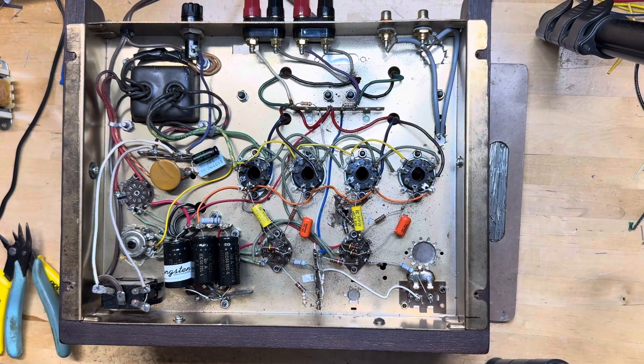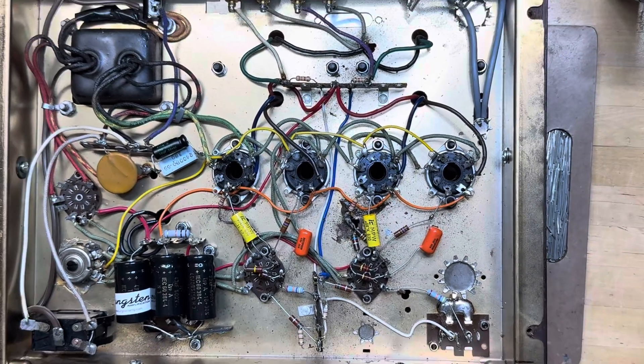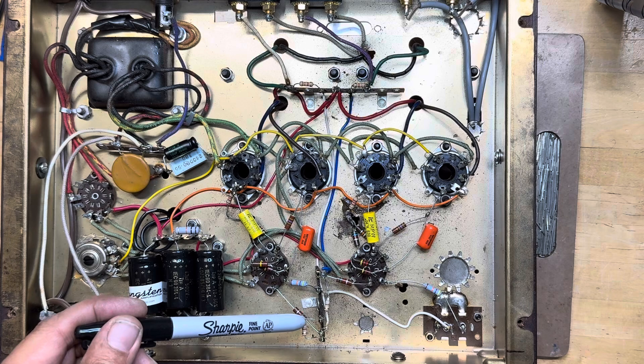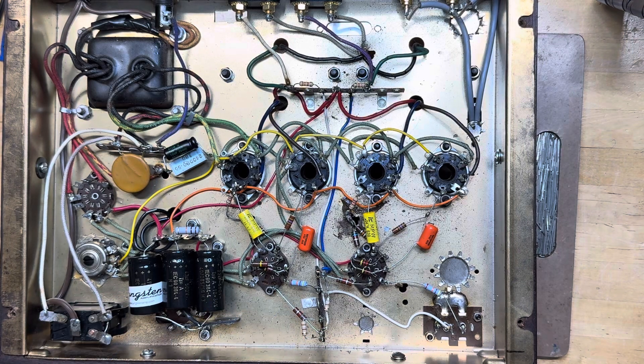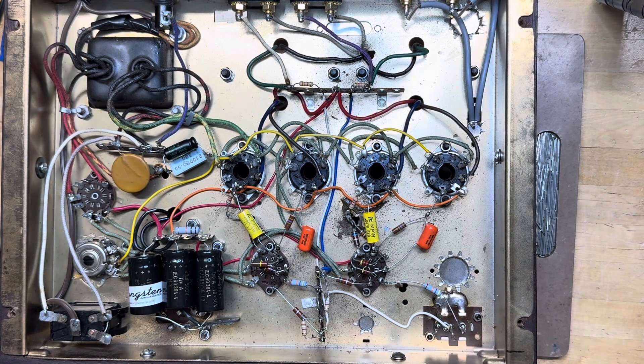Sometimes you run into non-obvious stuff that becomes a little tedious to search for, but when you find it and fix it, it's a glorious moment. If you're not familiar with these Magnavoxes, there are a couple of things you have to do in the conversion process. There's a pair of 390-ohm resistors — known as balance resistors — because the consoles had a balance knob on the AM/FM tuner portion that made the sound go from muddy to muddier to clear in the middle. Putting the 390-ohm resistors in replaces what was a 750-ohm pot on the original schematic. By putting those in you increase the volume, increase the punch, and clear up the sound. There's also another connection that has to be made in the power supply because the on/off switch was on the other part of the chassis with the AM/FM tuner — it was buried deep inside the console.